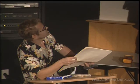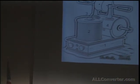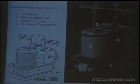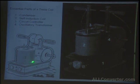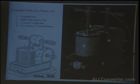This is a classic example of one of these Tesla coils. They look a bit different from the ones we see today. The main components you can see are a condenser, which is actually hidden in the wooden base, a self-induction coil, which is nothing more than an electromagnet. That's seen in the front of the unit. A circuit controller, which can be as simple as an electromagnetic interrupter or as complicated as a rotary mercury interrupter. And basically, oscillation transformer, which is the Tesla coil itself.